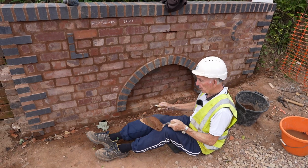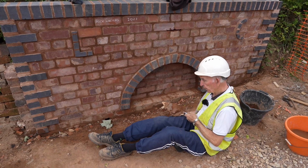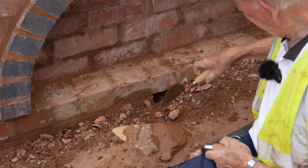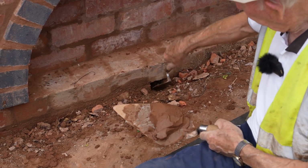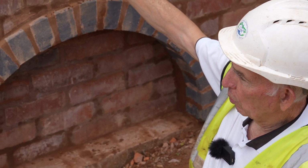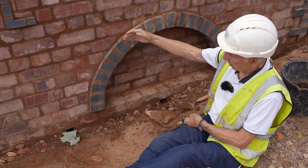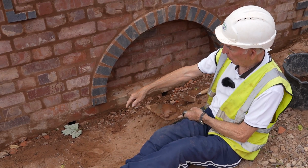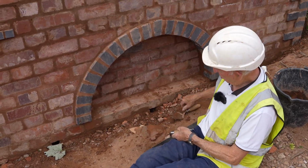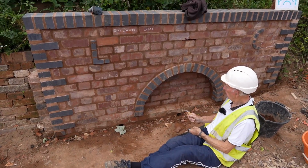And then they'll be removing this towpath to a lower level, and that will expose the weep holes, because I built weep holes there at the start. If there's any groundwater from the field, the water will just go through the gravel, come through the weep hole and onto the towpath. There won't be much, but it's just an option. That's how retaining walls are built.